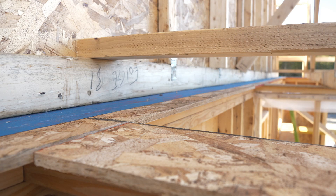This allows us to frame a chase below the OSB and eliminate any potential penetrations through the air barrier. Within this chase is where you run anything that would typically run in your attic — so this chase can be any thickness you need. It could run all of the electrical wires for your lights, pot lights, smoke detectors, any wiring for your smart home, any ductwork for your fresh air system. Whatever you need, you make the chase work for your home.